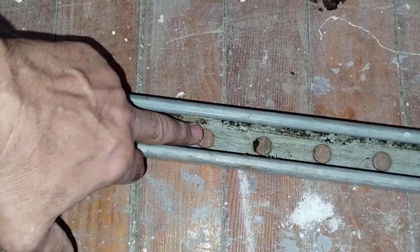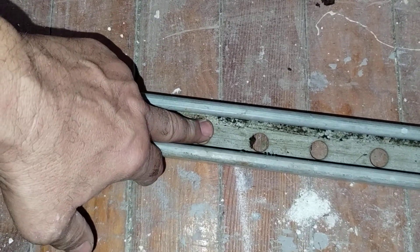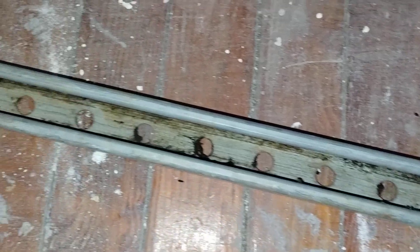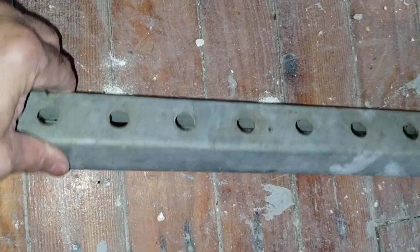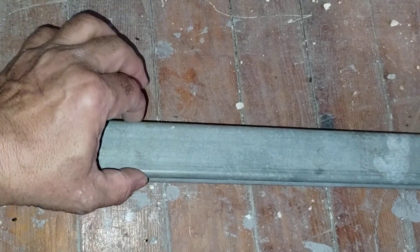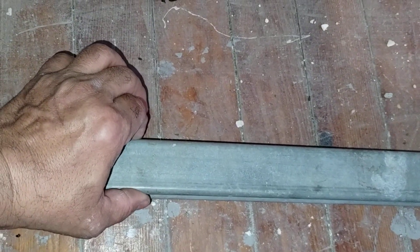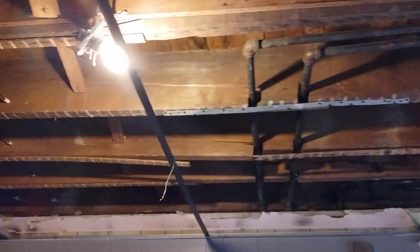With that one screw I can get 1,500 pounds of clamp force – though I haven't tested this lumber yet. If I can tighten it down and determine ultimate failure, I can do that. For the sport of it, let's put this unistrut on the underside of the floor joist and see if we can turn it into a beam – with the unistrut as a strong-back from the underside. I have multiple other ways to attack this, including the plate clamps, but I wanted to have some fun with this one since it's a bigger crack than I usually run across.